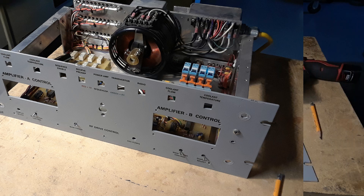With the water coolant flowing nicely, let's go down to the two high-voltage power supplies and turn on the AC primaries. With the primary circuits turned on, the next step is to turn on the filament switches for all the tubes in the two separate cavity amplifiers. After all that, the only thing left is getting high voltage for the plate circuits turned on, which is on a time sequence to give the filament a good warm-up time — but to save time we're going to skip over that step. Back up at the control shelf, the fans will turn on automatically, but just for effect here we're going to turn them on manually.